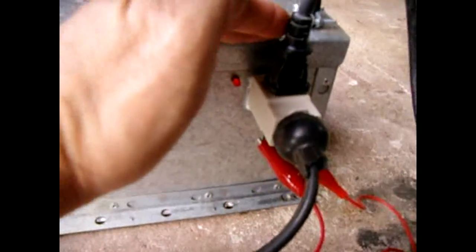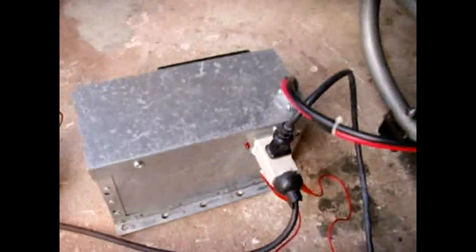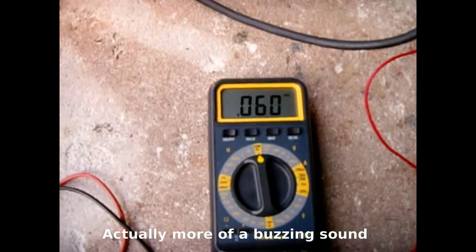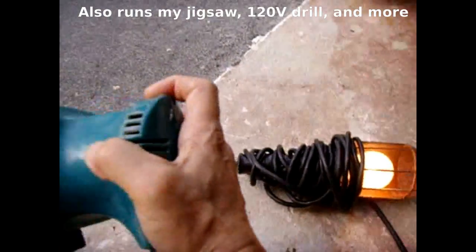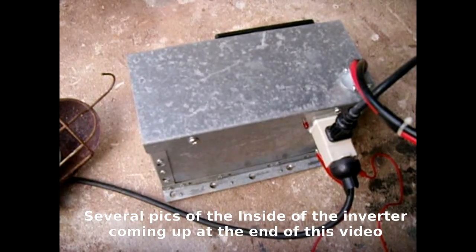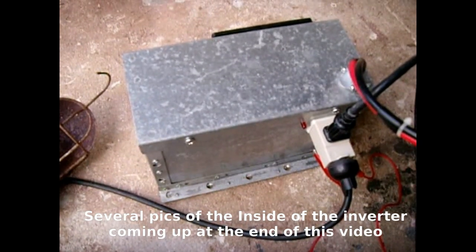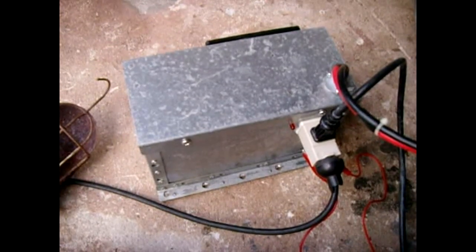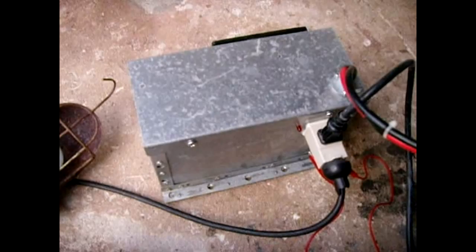You can see the light is on. The cooling fan is running perfectly, cooling everything, and you can hear the hum of the transformer. The frequency is reading 0.060 to 0.061 — right around 60 Hz. Now I'm turning the palm sander on. If this was connected to the battery for a long time and the voltage dropped to around 10.6 volts, the piezo alarm would start to sound to let you know it's time to disconnect. If you enjoyed this video, please subscribe, give it a thumbs up, and post links on other websites and blogs. Thank you.